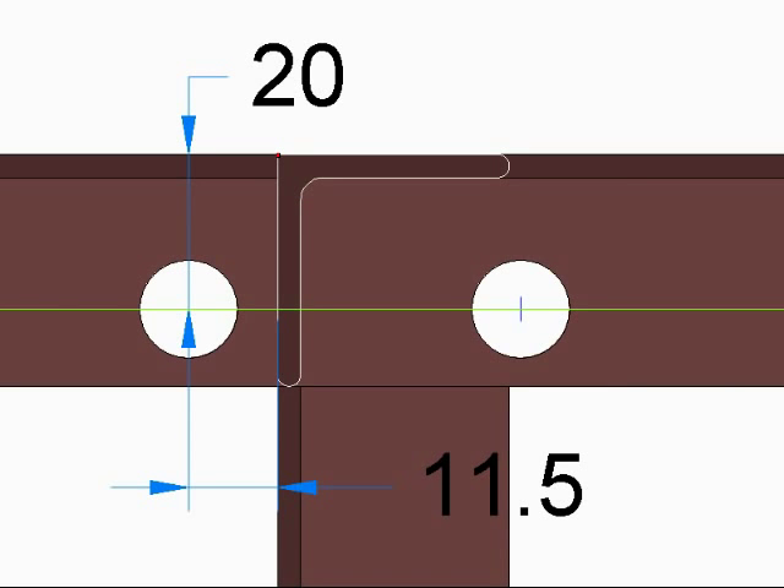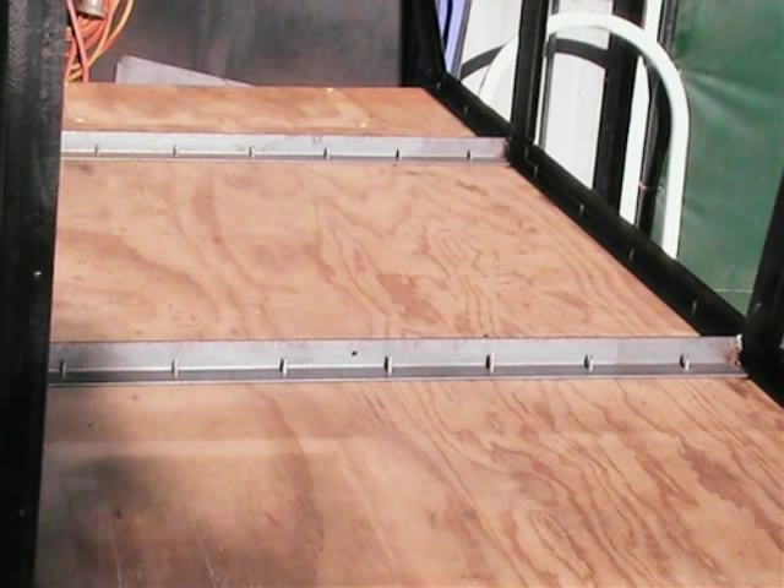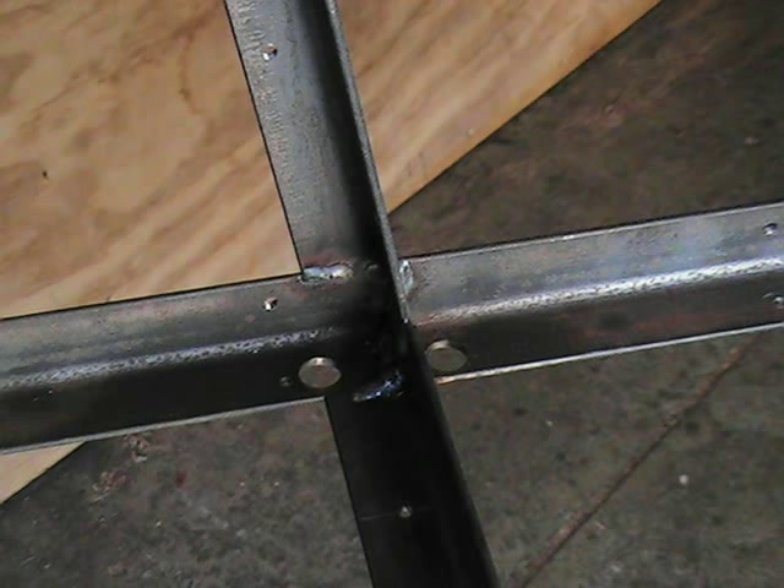Where the holes for the suspension mounting bracket are located on the base angle, I recommend that you first secure these sections to the base panel, then tack weld them in place, after which you can remove the base panel to reinforce the welds at a later stage.